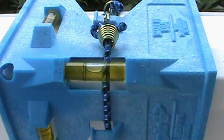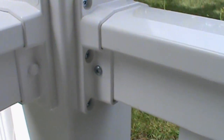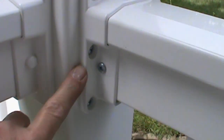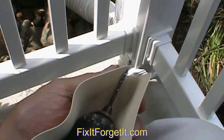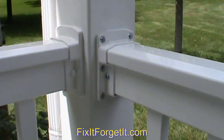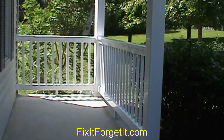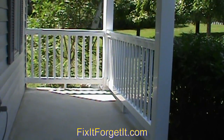This rail is going on nicely — nice and level. When you're drilling this little retaining hole in the side, you may want to get a little rubber pad and hold it around that drill chuck to protect the vinyl. So if the drill lurches forward as the hole pierces through, you don't scuff up that vinyl. The first eight-foot rail system is now installed. Everything turned out nicely. We will now move on to the next section.